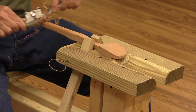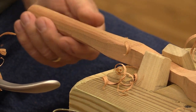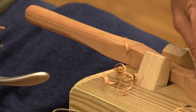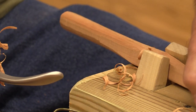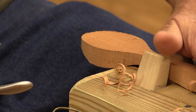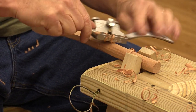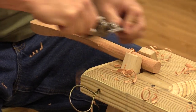This spoon handle is nice and straight so it really doesn't matter. When I made spoons using my bench vices, I never carved out the bowl part until I had the handle finished, because if you carve the bowl part out and put it in a vice you'd crack it almost every time. With this spoon mule I can work on the bowl and work on the handle and never have to worry about cracking the bowl part. Now since I cut this down here as a slope, I'm going to have to go back the other direction to work this part of the spoon.